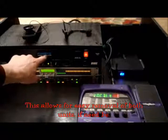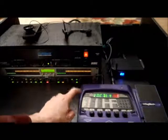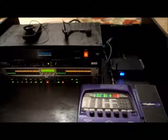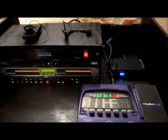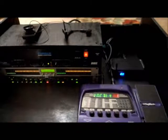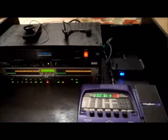To explain the rack mount unit: this is a Furman power conditioner, which is very important, especially when you're working with computer processors like what's in the Vocal 300. The misconception about the conditioner is that it would stop any type of power surge — that's somewhat true, but a powerful enough surge will blow through it regardless. What it's primarily used for is protecting against low current, which is also deadly for any computer system. If the current is too low, this will shut everything down and protect all your units.